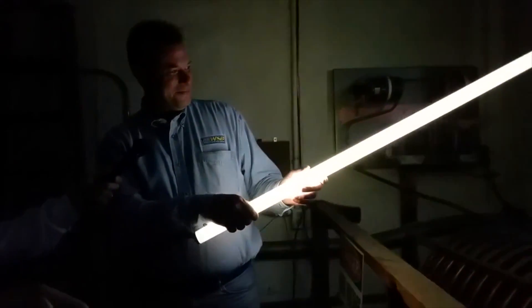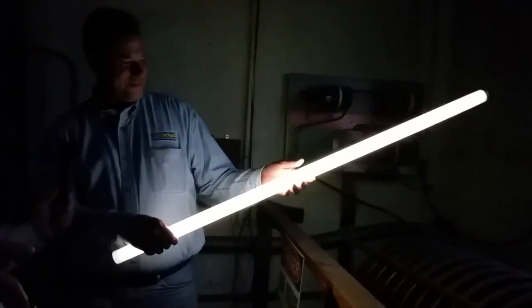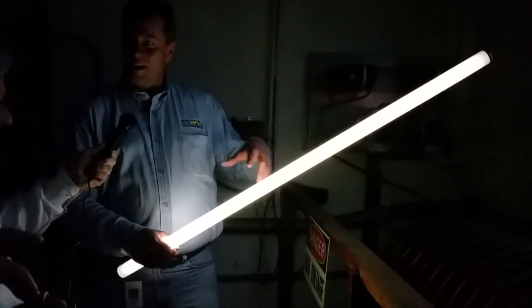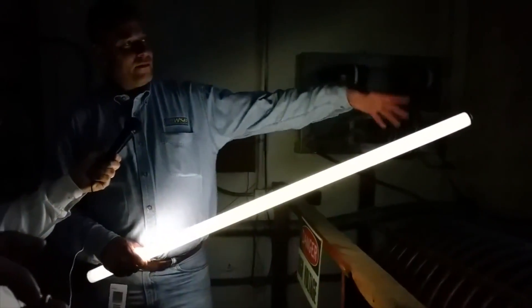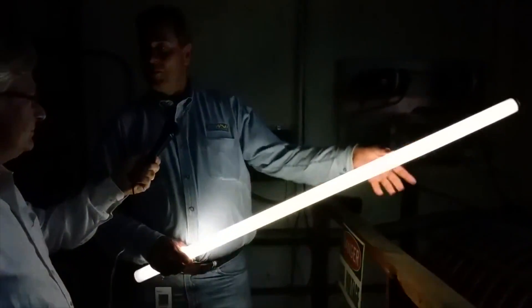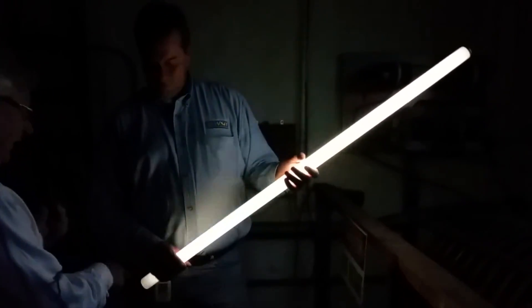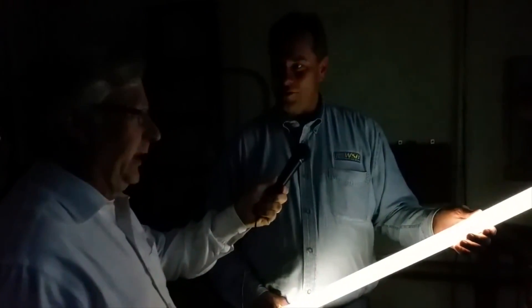Okay, this is a great party trick, but do you know exactly what's happening here to make that light up? Well, a fluorescent bulb works by stimulating the gas inside the bulb, and essentially the voltage in the air is stimulating the gas just like it would if it was in a socket. Obviously, this has nothing to do with the electrodes at the ends that normally light the bulb. Actually, that's the antenna — in this particular case.